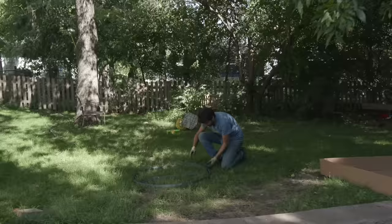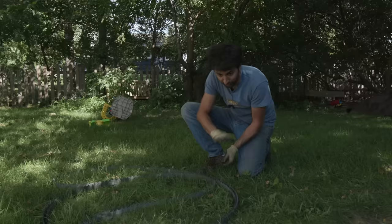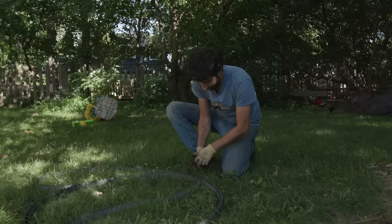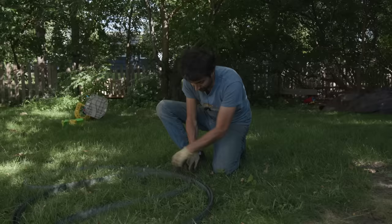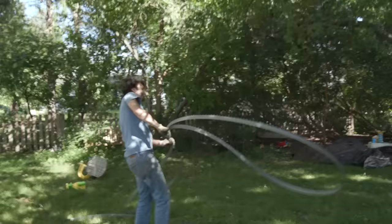And at least the idea that I haven't tested yet is that in theory, if you cut through some steel with this, the blade shouldn't wander off. You'll probably still damage it, but you'll be able to get out of that cut without a big swoop in it. So these guys are twice the cost of the standard blades that I normally use. But if it means I don't have those dips if I hit anything, it's worth it to me. So these blades are about $103 a piece in a 10 pack, and the other ones are $48. So we will get one of these guys on here and get back to sawing finally.